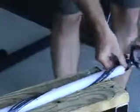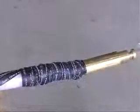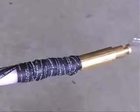The spiral needs to be applied with an even pitch to achieve the best performance. Once the tape has reached the crimp, stretch the tape using a 50% overlap to cover the last three centimeters of the white insulation. Continue over the brass connector and up to the black plastic section of the terminal base assembly. Cover the connector with tape whilst maintaining a smooth and level finish.